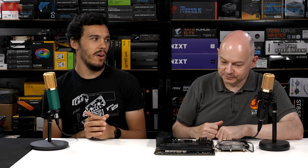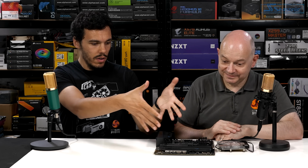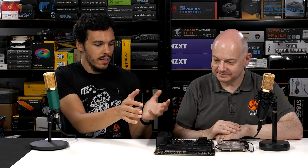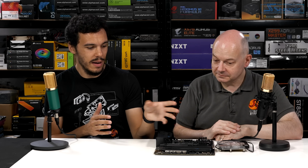How much power approximately does the chipset draw, or heat does it have to shed in watts? It was never really confirmed, and it was always the if this, if that. But it was somewhere in the order of 12 to 25 watts on the high end, I think. In mainstream use, I thought about 15. Not a lot of heat. It's not a massive amount, given that if you look at a board like this, all the boards these days have got covers, perhaps pointless, perhaps nice and cool and useful, depending on your perspective. There's plenty of surface area there to dump that amount of heat.